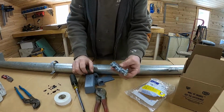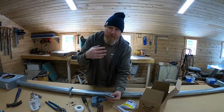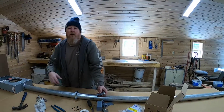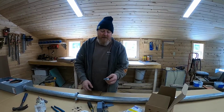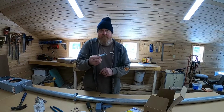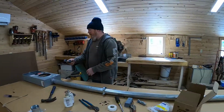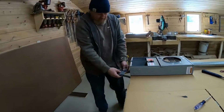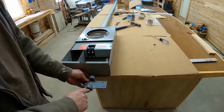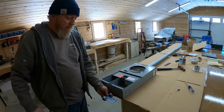So, anybody's ever had satellite TV installed or telephone companies come out, you might notice that they stick something in the side of the breaker panel, or they connect onto the ground wire with something. This is mandated by our local code, so that they have a place to ground without altering anything else that's grounded. So this will end up going on the building, just like this. Short piece of conduit between here. We'll screw this to the building, and we'll run a piece of conduit down to the ground, where the wire can be buried, and then go to the ground rods.